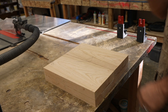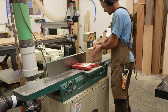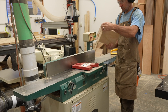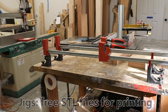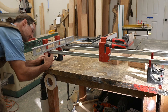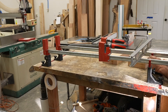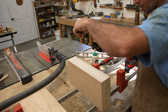After I have two sets of these, I mark on them with a triangle where I want them to line up, and then it's back to the jointer to flatten those edges. One of the tricks here is if you joint opposite faces, the glue line will line up perfectly because any slight variances in your jointer fence will be compensated for. For edge gluing those two pieces together, I make sure my jigs are aligned really well, because any variances over the length will produce a twist. I use a level to make sure they are perfectly level on both ends, and I sprinkle a little bit of salt to help them not slip when I clamp.